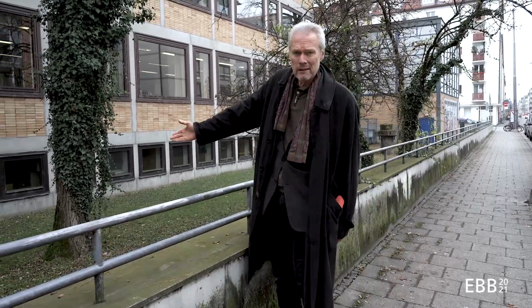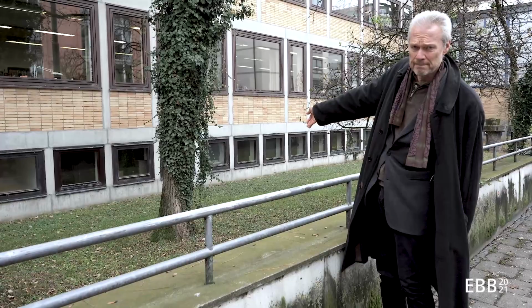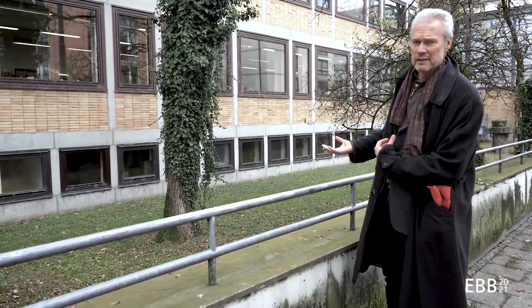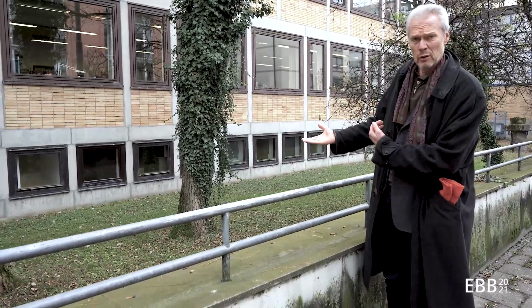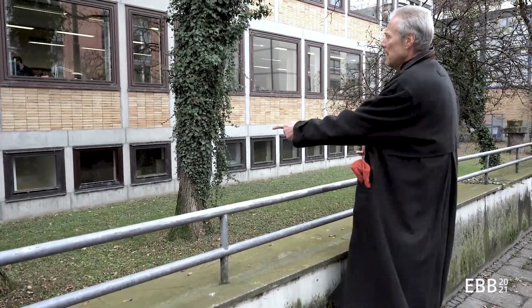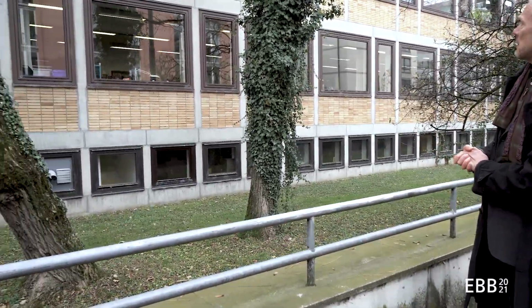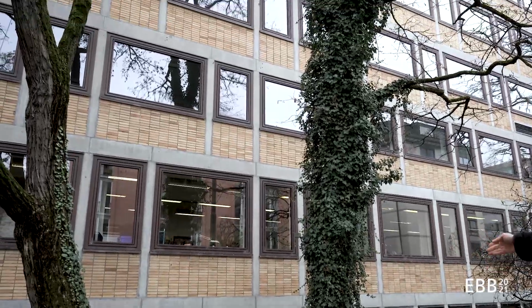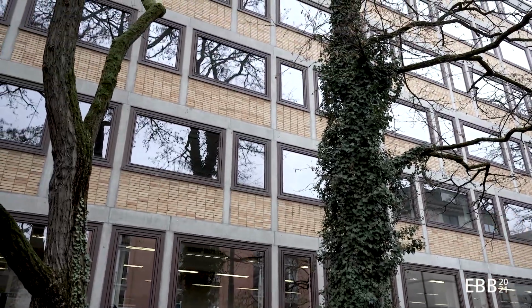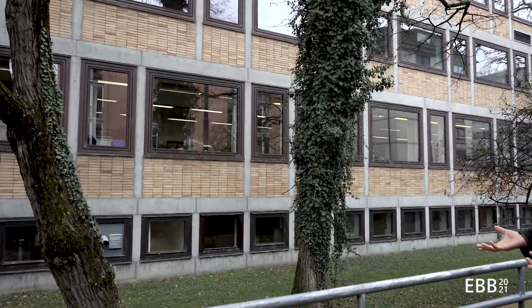So behind me, another building of TUM. You can see a lot of joints. So in my opinion, this is a facade cladding, which is rigidly linked to the load-bearing structure behind. And there should be concrete pillars behind those that continue through all the stories. And there are others which are not continuous, so behind those there will not be a load-bearing structure.